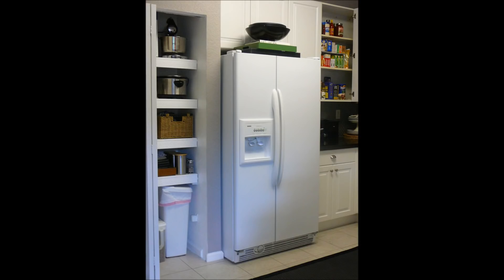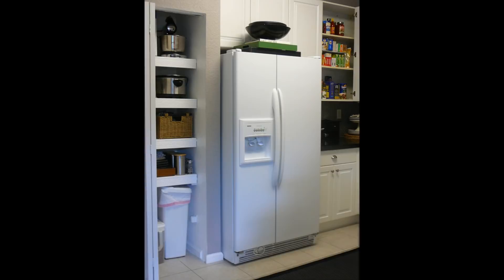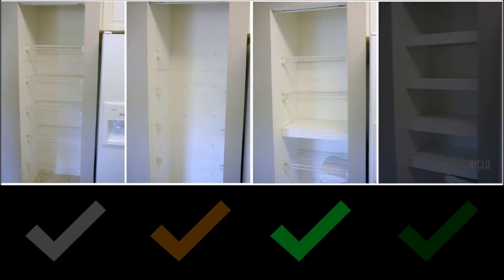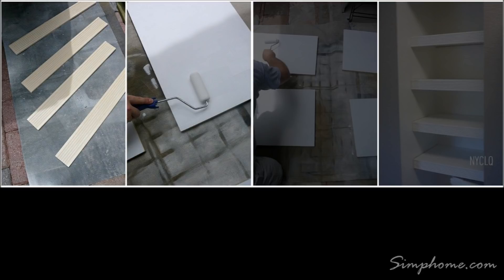9. Cover up those cheap-looking wire shelves in a pantry or closet. They did this for only $28. The project needs 3.5-inch wide molding to cover over wire shelf cups — the only expense. Pre-cut to specifications at Lowe's or Home Depot. Instructions: Clean out the space. Cut the molding with the measured specification. Then remove the wire shelves, clean them, and give the space a refreshing coat of paint. Paint shelf pieces separately outside before putting together and let dry in the sun. When adding molding, run a bead of glue, then use finishing nails to hold together.